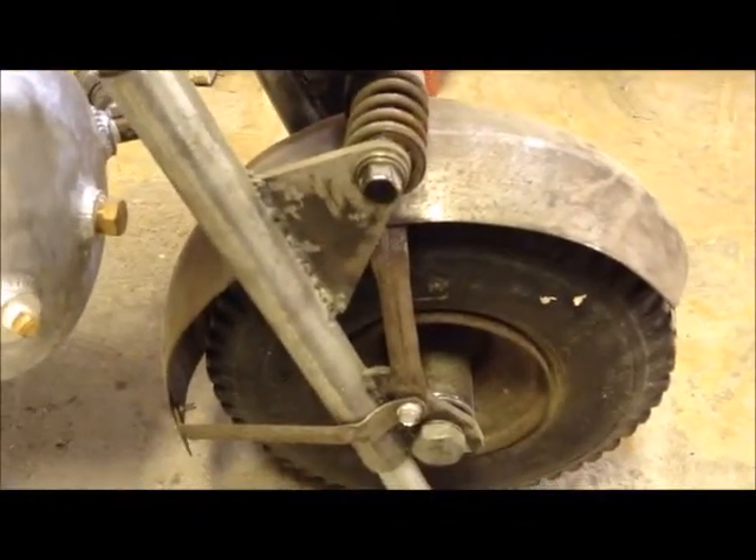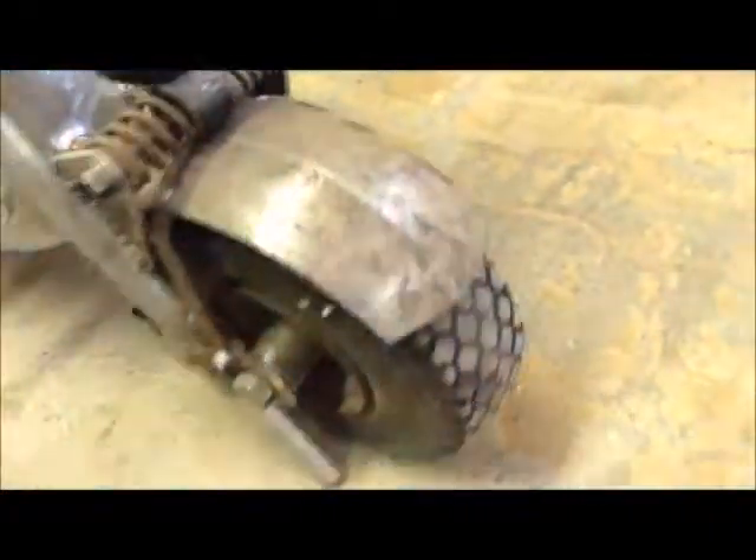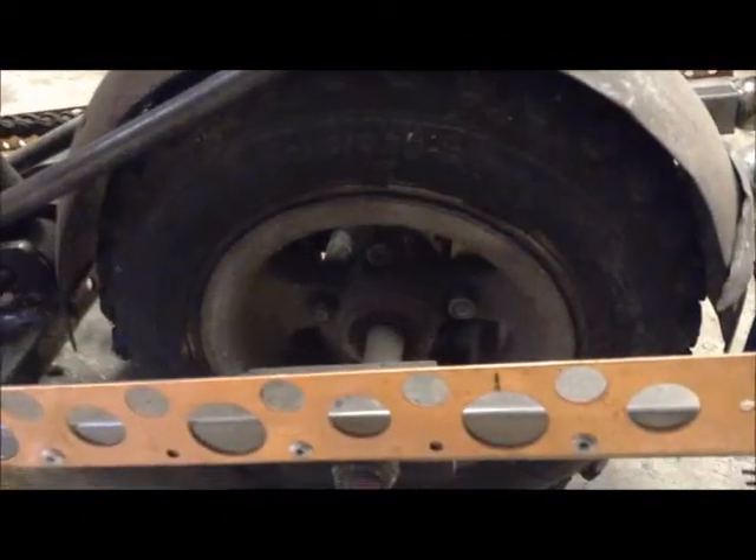Custom fenders — they're actually from the same 1950s bike, but I rolled and bent them so the radius would match the tires, which also made them fatter and flatter to fit the mini bike tires better. If anybody knows what this rear tire is, let me know. It's a Carlisle tire made in USA. The wheel is a four-bolt, four-spoke mag or aluminum that comes in two halves so you can put the tire on easier.